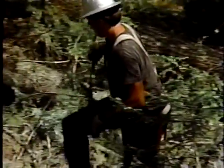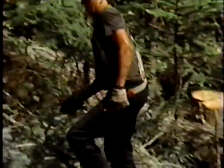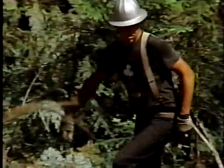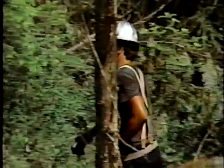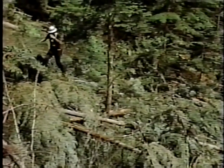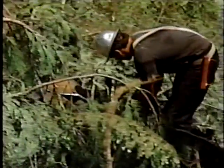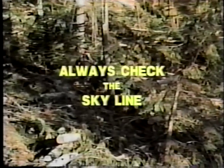When you reach the tail stump, use the same notching and securing procedures and precautions as you did for setting the guy lines. Once the skyline is secure, you're ready to raise it. Get clear, then radio the operator to raise the line. When he has done so, you must take the time to check the line to see how it's holding. It's your judgment call as to whether or not the line will do the job or needs to be re-secured.